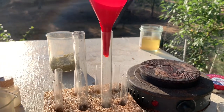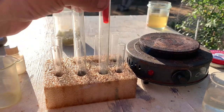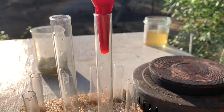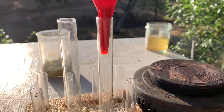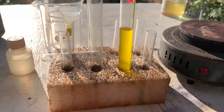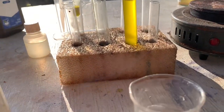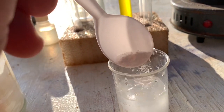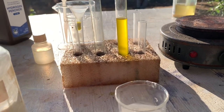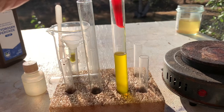But you need to have a lot of tools too to get that. Right now I'm filtrating — it takes maybe half an hour because silver chloride is very hard to filtrate, and it already looks like we're almost done. It's very slow, so I leave it for a good half hour and come back. Filtration is almost over and I'm now making an SMB water solution — I think this works best. Adding some SMB and trying to dissolve it — when it dissolves we'll be ready to precipitate that gold. There's not a lot since it's just two rocks I'm testing, and so far results are good.